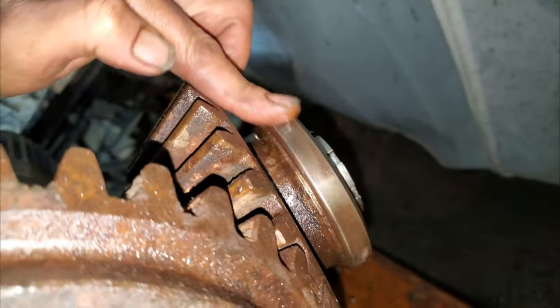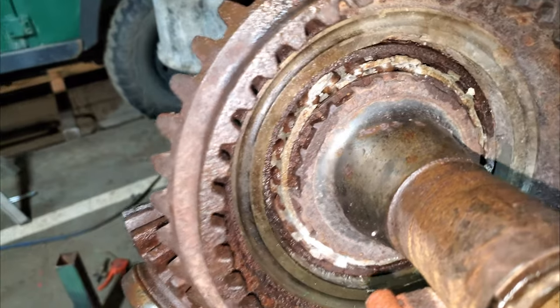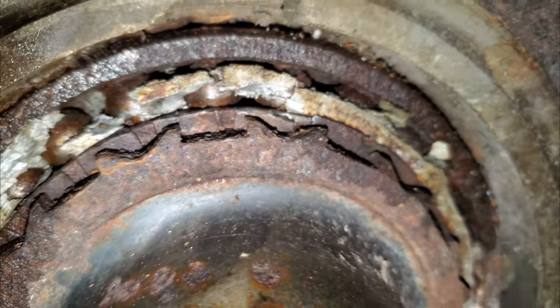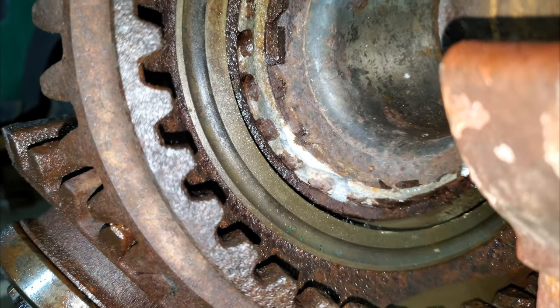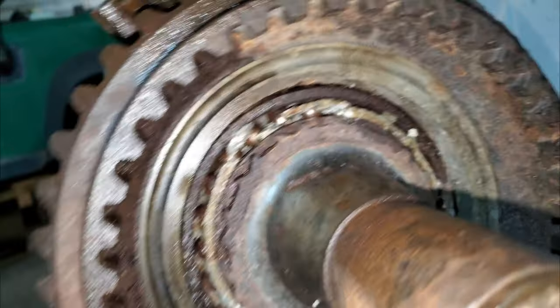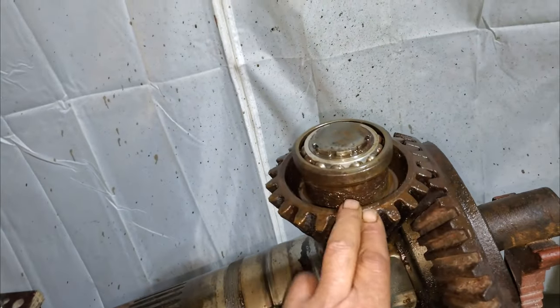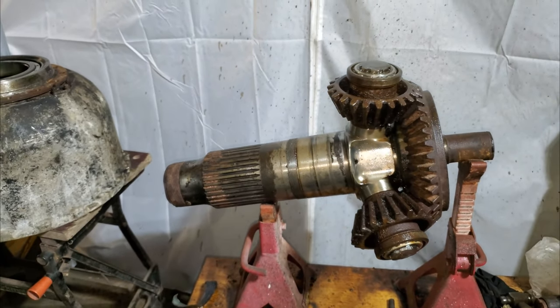And that one's free. So that only leaves one bearing. That one in there. And that one doesn't look very happy, as you can see. Now, if I replace that bearing with another one, this whole assembly, theoretically, providing these are free on the shafts, could all rotate.